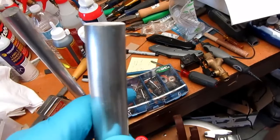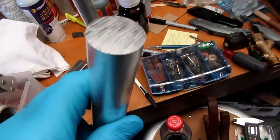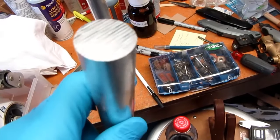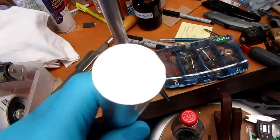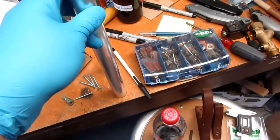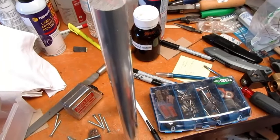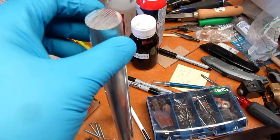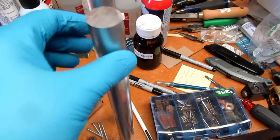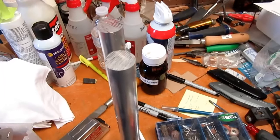And meanwhile, I've ordered some more aluminum round stock from Amazon, this time 1.5 inches, substantially bigger. I wish they would have had 1.25 inches, but it's not a big deal. I'll chuck that up in the lathe and turn it down to the diameter I want. I'd rather do that than have these undersized ones flopping around loosely in there. That'll just bug me. I should get it tomorrow, so it's only a day's delay.